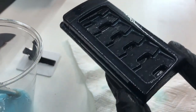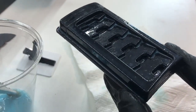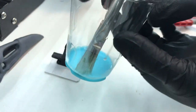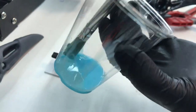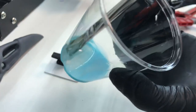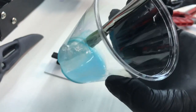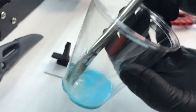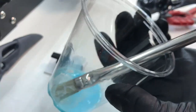I'm going to stick this into the UV curing station and we'll see what it looks like. After coating both items, of the maybe teaspoon amount I poured out, there's still more than half of it left — so it used very, very little. A good idea is to not only decant the amount you need for right now, because you might want to pour some more for a second coat — just be careful with your estimates.